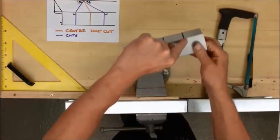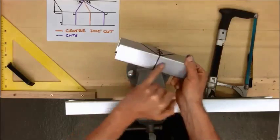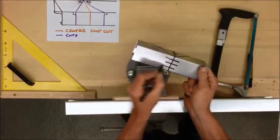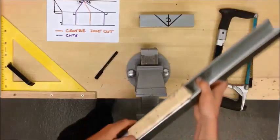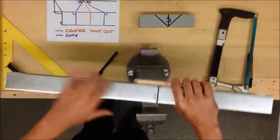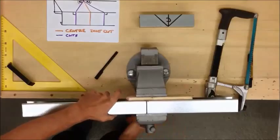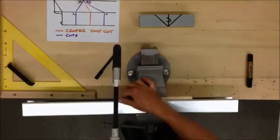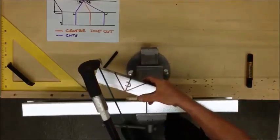So I've cut down this line and all the way this line to that point. We do not cut that back edge - that will become our bend. Move the timber along and support my cut so this is not moving. And the same again, if you're less confident, cut on that line, then cut that line when you turn the piece around.